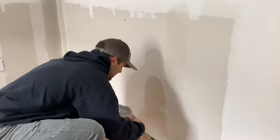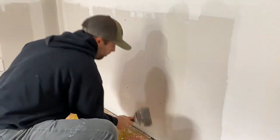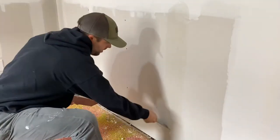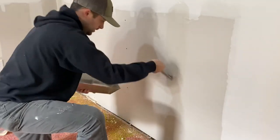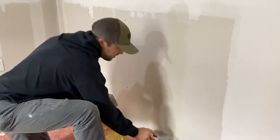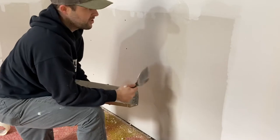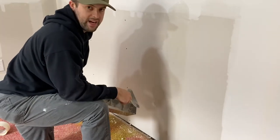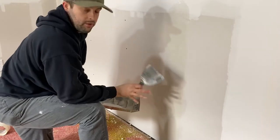Up and then down. There's my other little nail hole right here, so I'm going to fill that in. The reason I do this from the top down — and you'll see that in a lot of professional work — is because it's much easier to sand. You're going to get a better finish, it really does save time.